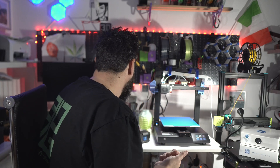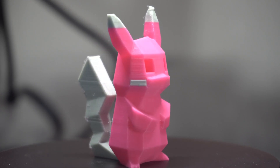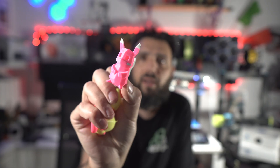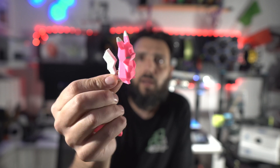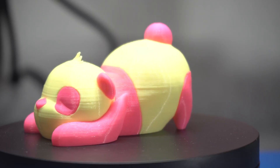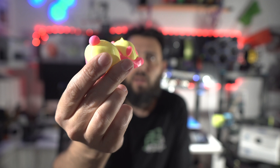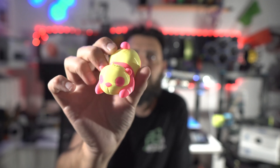The dual color mode works really, really well. The first print I did was a Pikachu printed directly from the SD card — in neon pink PLA from Azure together with a mint pastel color. I love that combination. The first piece I sliced myself was a panda — two STLs were on the SD card, I merged them with Prusa Slicer, and it came out really nice. The aim of a dual extruder is usually dual color prints, and this delivers.